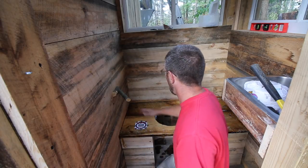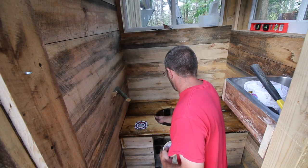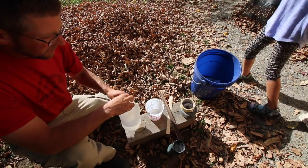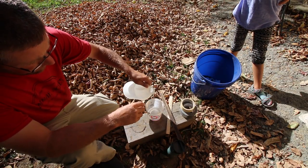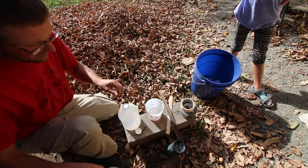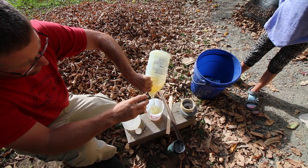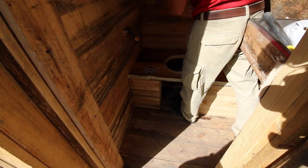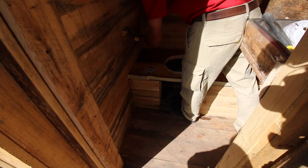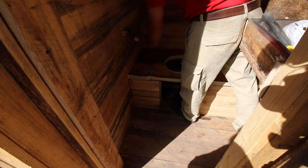We're not 100% happy with the outcome of the bar top epoxy, so we've just scuffed it up. We're gonna put another coat on. We're just mixing up our two-pot epoxy resin. It's a 50-50 mix. Using the rest of it up, just gonna go half and half, and then going to pour it in place and let it flow out. It's thin enough so it self-levels. Gotta make sure we get that sticker good, huh, Libby? Yeah.